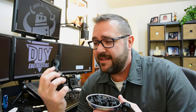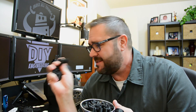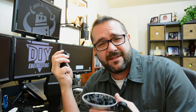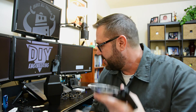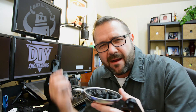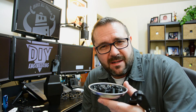So we ran through the parts and they came out pretty good. We got the Taz dialed in in terms of the slicer settings, and these things turned out with really tight tolerances. The gears mesh really well — about 24 different gears at various ratios that all go into the gear train. This is what's going to make the legs move. Got tons of little parts, tons of legs. You see a body over here — it's a black model, but we're doing our own thing: this is going to be like an Anarchy Stormtrooper version of the AT-AT Walker.